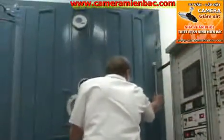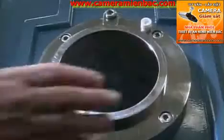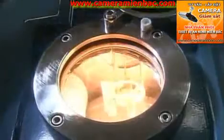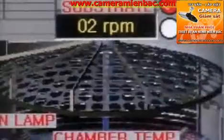They group some lenses on round racks called planets. Their universe is a vacuum chamber. The technician closes the door and the planets continue their orbit. Inside this vacuum, an electron beam evaporates coating materials. The vapor rises to give the lenses a protective coat, and a computer monitors the rate of evaporation and the coating.